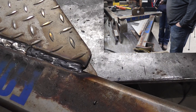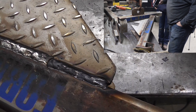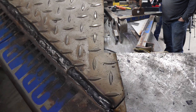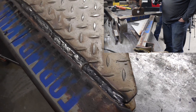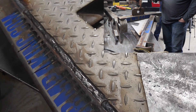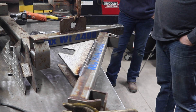Flux core is just a really nice system. The flux helps to stabilize the puddle, helps give it different properties as it cools down — like more elongation, more ductility. It's just a really nice system. Let's finish the rest off with flux core and see what it does.